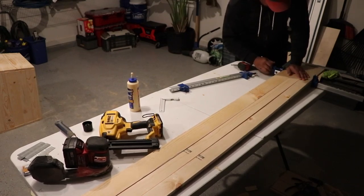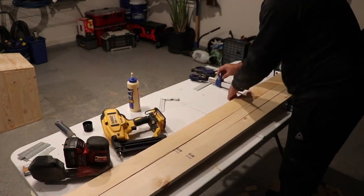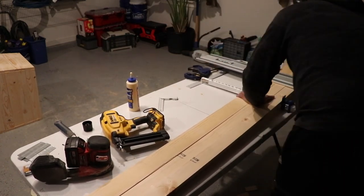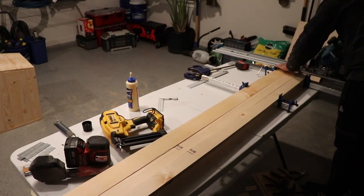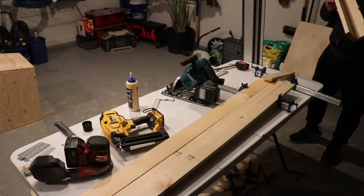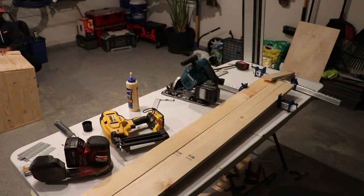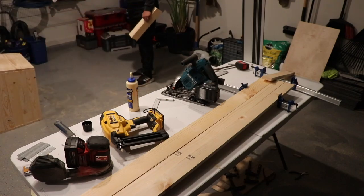Here I am working on my corners. I originally was just going to do some corners here. I found the angle by laying the wood on the box, getting the sides even, and then marking my angles at the top and bottom. One is a one-by-four and the other piece is a one-by-three, just so that the reveal is the same on each panel, because I'm overlapping one side as you can see there.